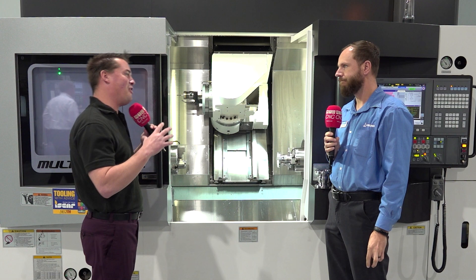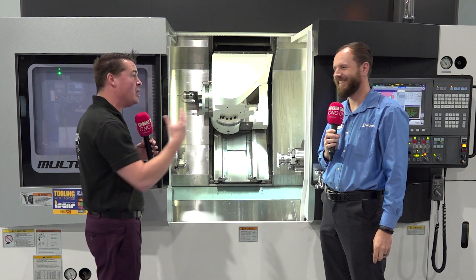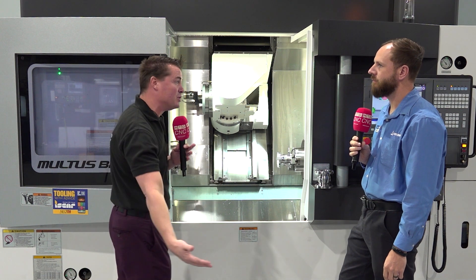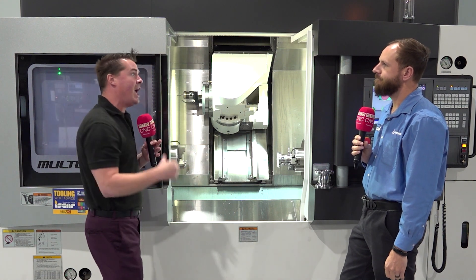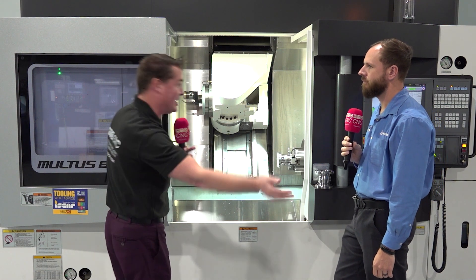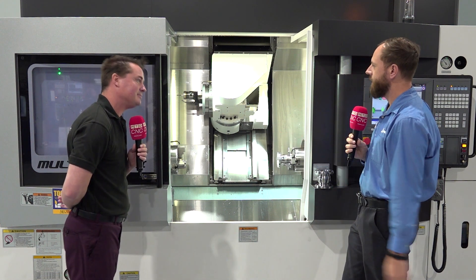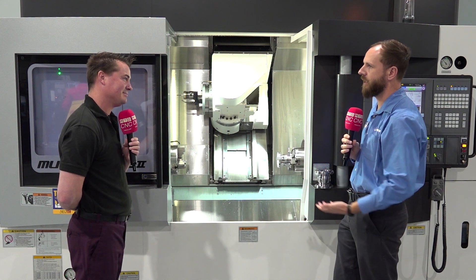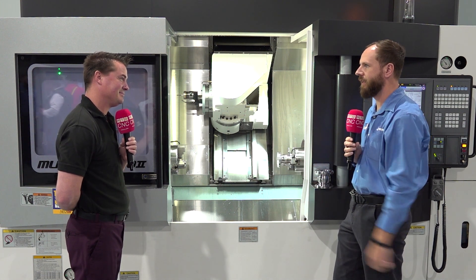Now that you've answered almost all of my questions — and probably the audience's questions too — if we haven't, leave it in the comments and Craig will be able to answer everything. The last thing I want to ask about is the automation side of things. We've talked about front side, back side — can we hook up a cobot or robot, move it over to a CMM for measuring, and take it from raw blank all the way to a box and ship it out the door? Yes — on this machine we can interface with a lot of off-the-shelf robots. We can put an auto door on it, and we also have a solution where a robot is built into the firewall of the machine with an auto door and a stocker that comes in right here. The robot parks up out of the way, and you can run it manually during the day or when proving parts out. When you go home, you slide the stocker in and let it run the automated job.